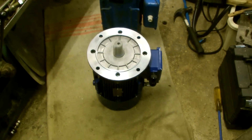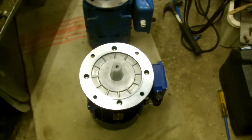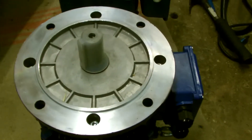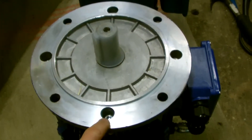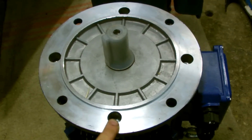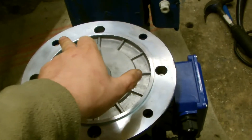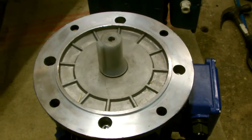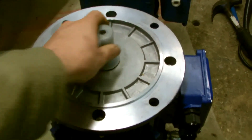On this particular arrangement you can see the screws at the far left and far right and extreme top and bottom. The other four holes which are on the diagonal may end up posing a bit of a problem for mounting to the new lathe. These bolts here are the ones that hold the flange to the motor casing, and these four holes here are for attaching to whatever appliance you need to give motor power to.